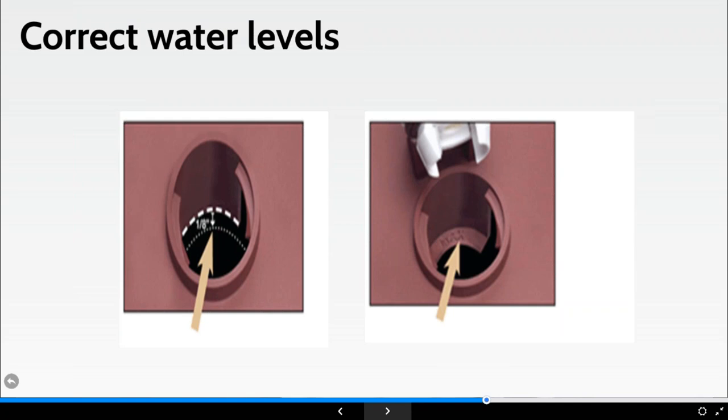So generally speaking, we tend not to have baking soda at work. So you may have another solution that's specifically provided for batteries, but you are going to get copious amounts of water on there and flush and keep it flushed. Okay. So clearly that procedure, what I'm showing you there, doesn't have to be performed on machines which have sealed or maintenance free batteries. So you can see the risk is less there. But in truth, there's a hell of a lot of machines out there with lead acid batteries.